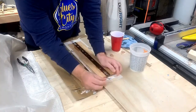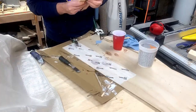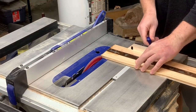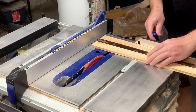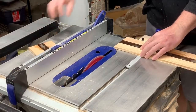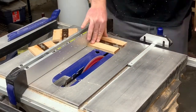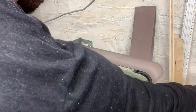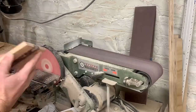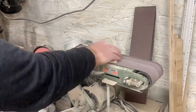Removing everything involved a utility knife to cut away the hot glue and a chisel to pry it off the plywood. Then it's back over the table saw to cut it into sections — in an unsafe manner, I should note. I should have definitely used a stop block here so the piece didn't kick back. I used a combination of the disc sander and the belt sander to remove all the excess epoxy. If you value your lungs, definitely wear a mask while doing this — in fact, you probably want to wear a mask anytime you're working with epoxy.